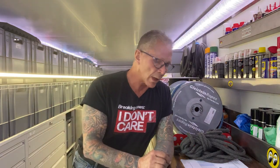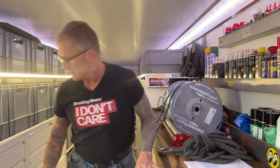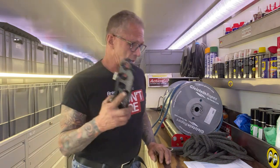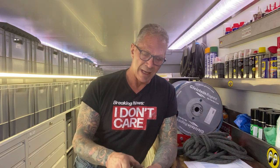Then we get into the more specific positioning ropes which we use. Yesterday we talked about performer flying rope, and that's all 6mm, generally 6mm Technora. But you have to transition to something, normally between your workstation and your head block, that will fit in your clutches, that will fit in your friction devices like gold tails. Because they generate so much friction, and because you want positional accuracy on a gold tail drop, stretch is not your friend — things will tend to be plus or minus depending on the force and the stretch. So it's not ideal.